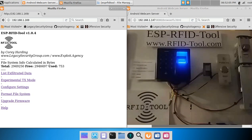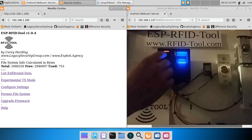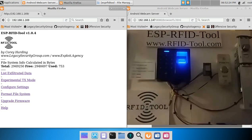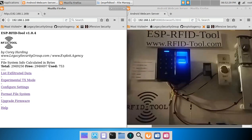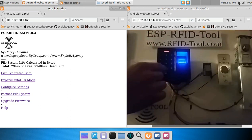Now let's tie that card to a valid user ID and also enter several fingerprints and PIN codes. Your reader may be different, but this particular reader's administration panel is accessed via star 123456. I will erase any stored credentials now for the purpose of this demo by entering star 2, then four zeros, and finally pressing the pound symbol.